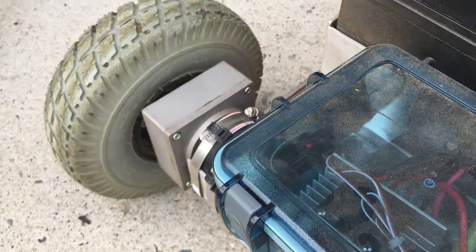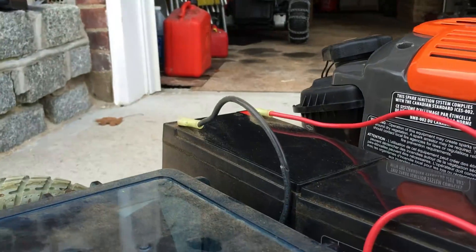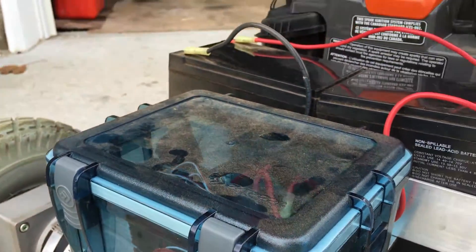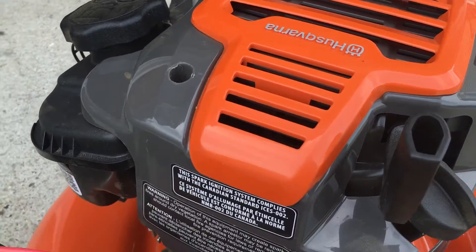In between the two of them I'll try to get down here and show you — I braced it under here with a piece of metal, also from Ace. Cut it down, and that supports the two L-shaped brackets coming up. Everything I screw into the unit is double-bolted with lock washers so that the vibration won't open anything up. All of your screws should be double-bolted so that vibration does not undo any of your nuts and bolts while you're cutting your lawn.